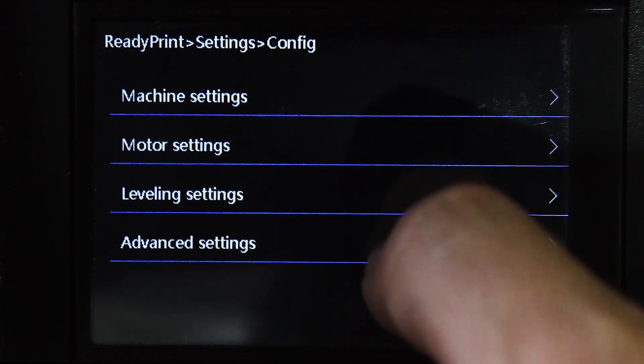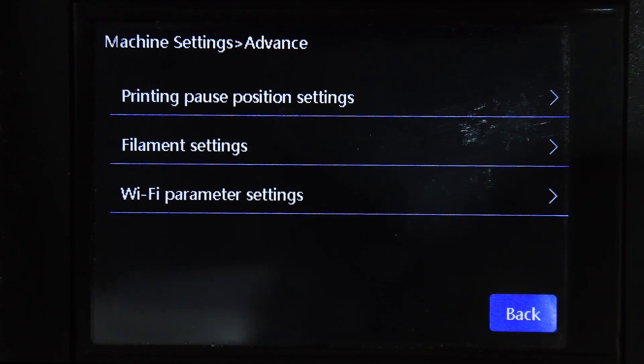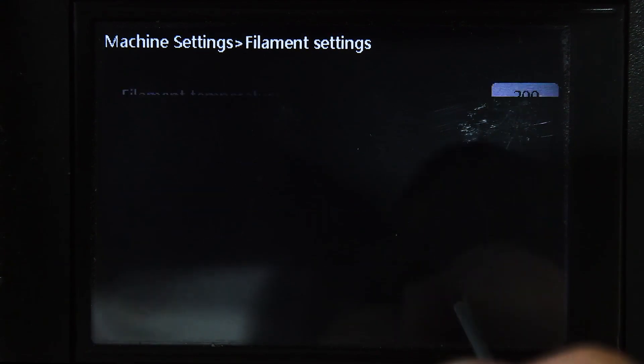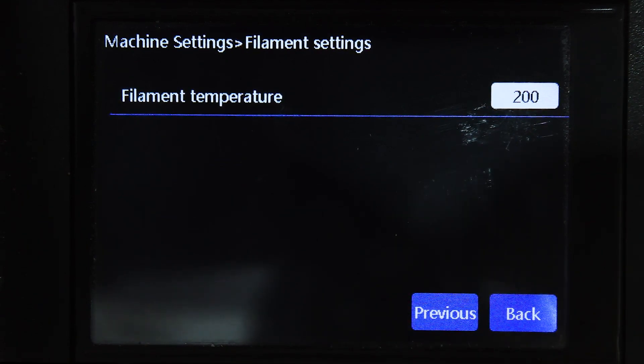The last setting is Advanced Settings. In there you'll find the printing pause position — set it to pause exactly where you told it to, or it comes back to home in the corner closest to the screen. Then Filament Settings, which sets the amount of filament coming out of the nozzle and the motor speed. If you want more flow rate, increase it. You also have unload and load speed and length, controlling how much filament is spat back out or fed back in when changing filament.